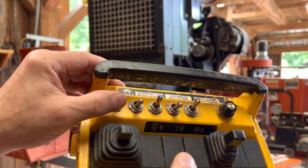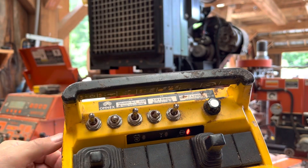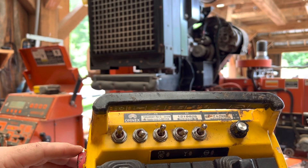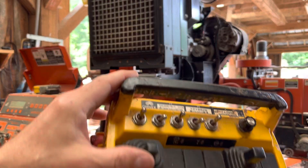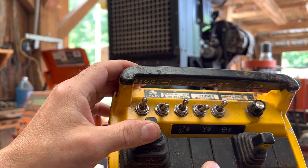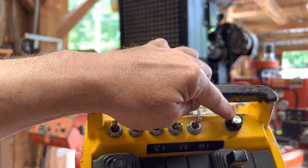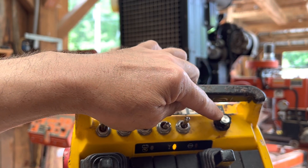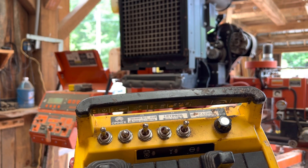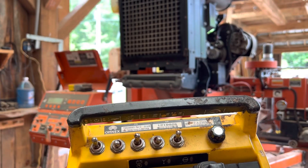So first thing you're going to do is hit this up — you'll see a red light coming on over here — and then you turn your main on-off stop, and that gets you started. If you push this button forward, the mill goes forward. If you want to speed up, you can control your speed right here. So as you're sawing your log and you're standing back, if you hear that your motor's working hard in the cut, you can adjust your speed from back here.